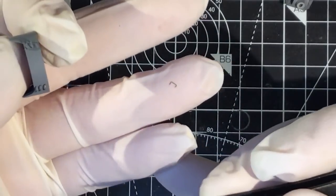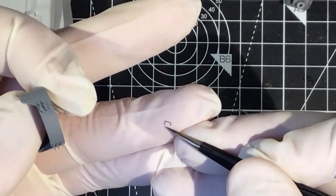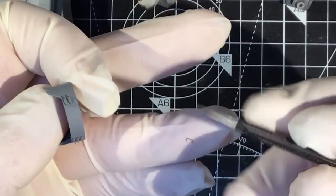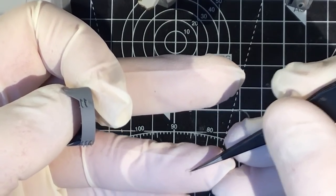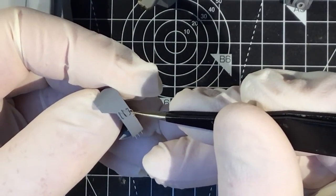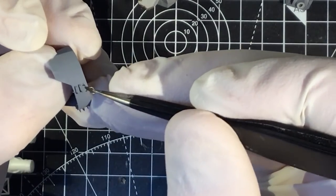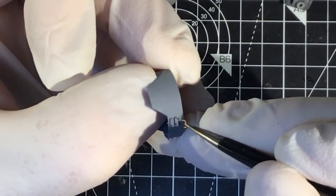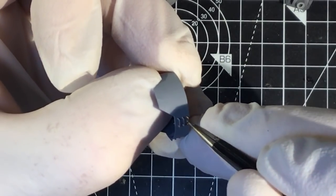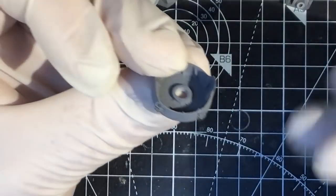And when I've cut these parts off the fret, you see the last one to go on here, I've cut them unequally. So I've left one side of the leg, which goes into the hole, a bit longer than the other. And that just avoids us having to get the two holes if we were going to use the template in a straight line. It's easy enough to get one set of holes in a straight line, but to try and get two rows is another matter. So you can see how much easier that is to do. So that's come out okay.